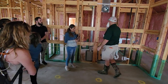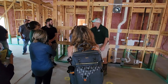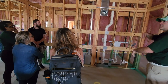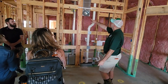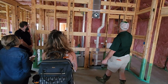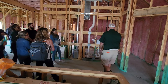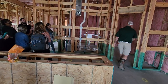Notice we have our strike plate here protecting our plumbing pipe. What are all these little pieces of wood — why is it in here and not anywhere else? Cabinets. You've got to have something to mount the cabinets to — you can't just mount cabinets to drywall, they'll fall off. So I've got electricity, here's our vent hood going out. Wherever we saw that other vent, that may have been a dryer vent going out to the side. I've got my refrigerator here with its connection.